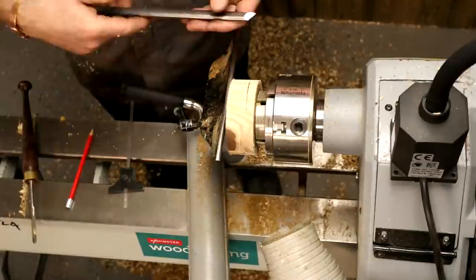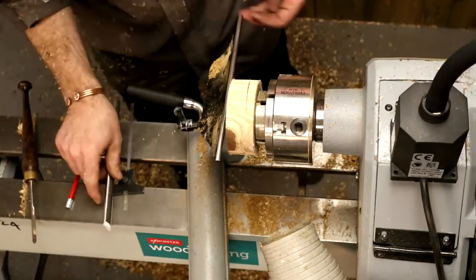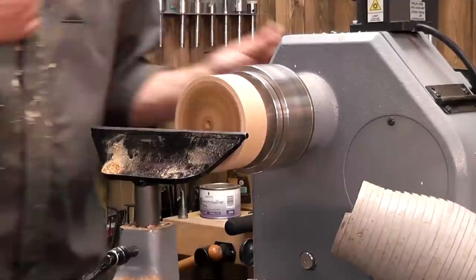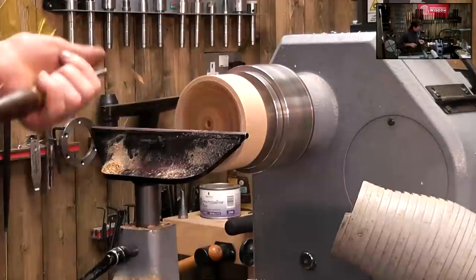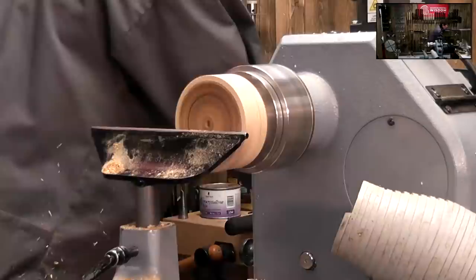The major thing with this: no handle makes it lighter to operate - I haven't got that weight dragging it down. To sharpen: I go up and down on the grinding wheel to do the curve on the back; on the top it's hollow like you normally would. Do not sharpen this corner because it goes under your wrist - not a good place to have a sharp edge. We're going to do a cut in the middle - engineers watching might recognize this as a center drill technique. My little spindle gouge can go into the middle and drill a hole. You could use a drill bit in the tailstock if you like.